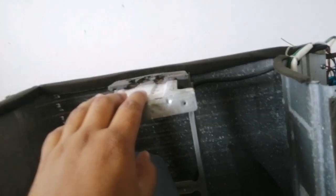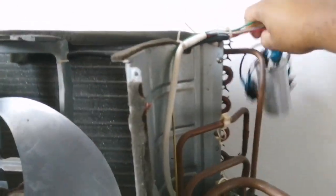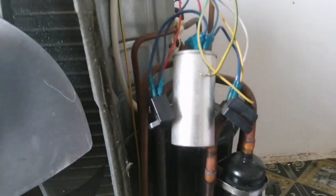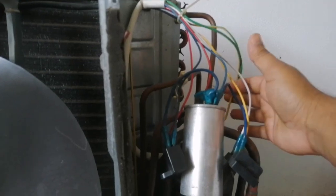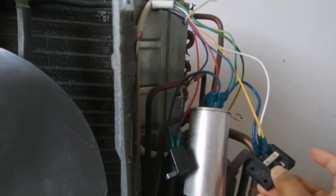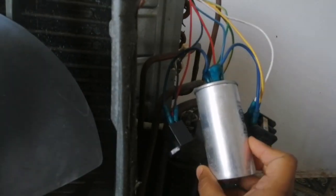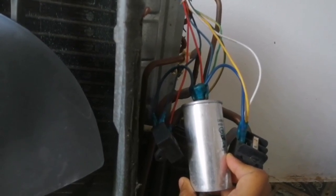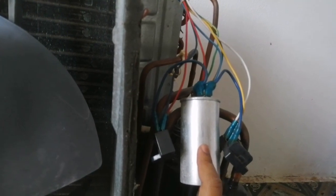This is the base of the fan and fan motor, which doesn't allow vibration from the fan. In the electrical part of the non-inverter air conditioning, we have two earthing wires and a power terminal — the supply comes from the indoor to the power terminal, then it goes to the running capacitor. The work of the running capacitor is that it gives the system the initial boost needed to turn on and also provides continuous power to keep it running.